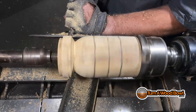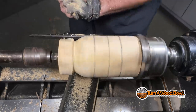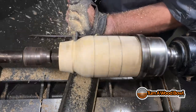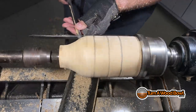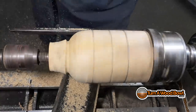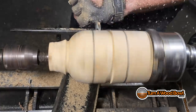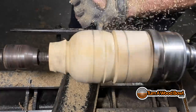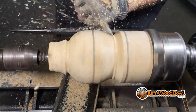I have a video all about supported grain cuts — check that out if this is at all confusing. What I'm doing is rotating the tool to the left and slowly starting that curve. This excess material on the end can be removed quickly, and then it allows me to continue the curve shape. Watch across the piece you're turning as the shape is being formed — you don't want to watch right on the tool, you want to watch the shape at the top of the turning. Take your time, make small cuts, and work both sides so you can compare.